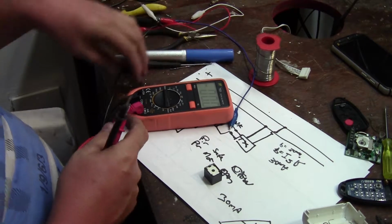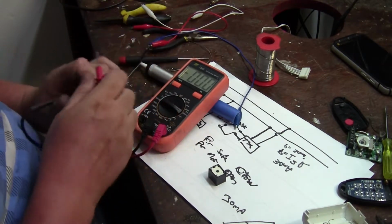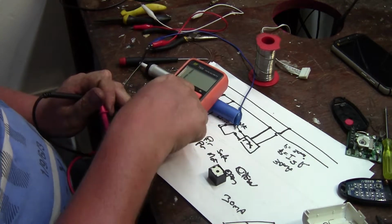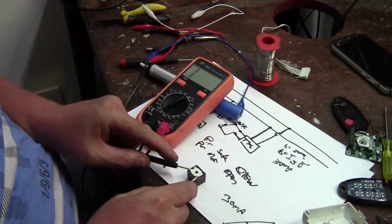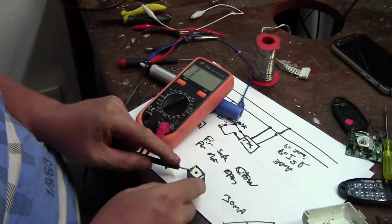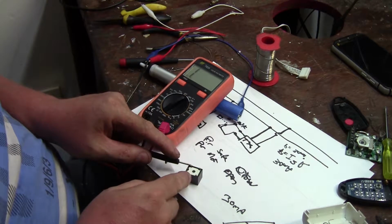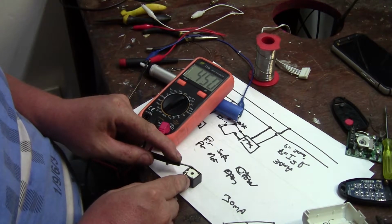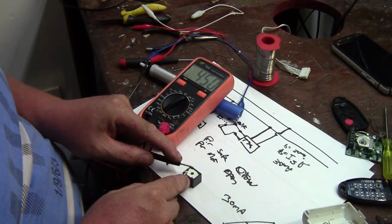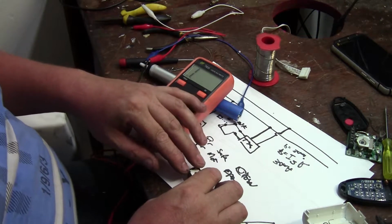Okay, so without anything connected to the circuit, the coil will be the terminals showing a resistance between them. Not a low resistance like the 0 ohm short, because that is the normally closed terminal. So nothing on there. Let's try those two. Okay, we are getting 0.450 kiloohms, which means that's 450 ohms. So those two would be our coil.